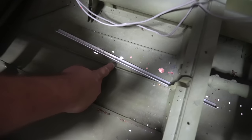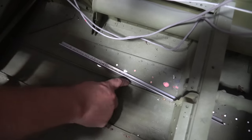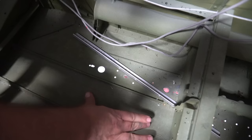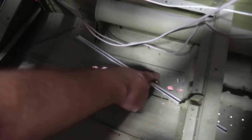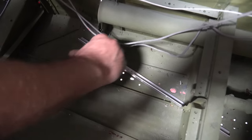We're going to have to splice this in the middle somewhere once we push it all the way in, so we need to undrill these rivets to get this piece to come out a little bit so we can cut it and get the new piece in to splice with it. This whole plate might have to come out — we might have to take these loose too so we can get in there.